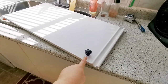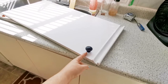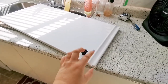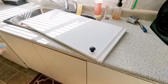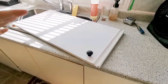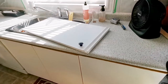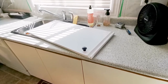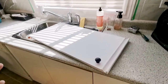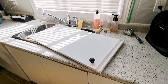The important part here — since there have never been knobs on these doors — is to measure. Make sure the distance from the corner to the knob is the same on all cabinets so they all match. If you don't measure and write it down, you'll have different levels of knobs across the top and it'll look unfinished and rushed. Even when doing things cheaper or on a budget, if you take your time it ends up looking so much better. Enjoy the process and make it look fabulous.